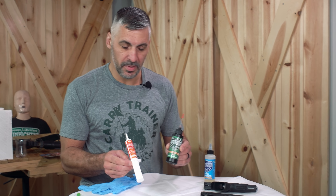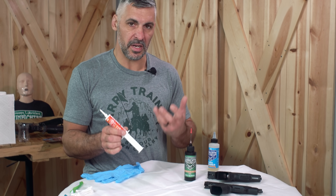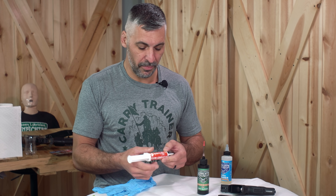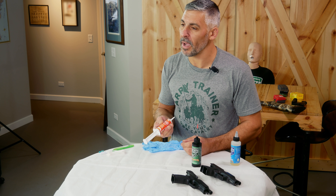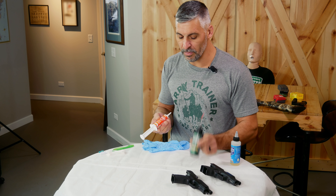Both of these are lubes, but this is a liquid lubricant suspended with some binders. Technically speaking, grease is — or was — a liquid lubricant of some sort that is bound together to put it into a paste or cream form. Ours is a pretty lightweight grease, and why would you want to use it? Well, it stays put much better. It's more prone to stick to certain surfaces that have a lot of reciprocation over a liquid.